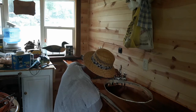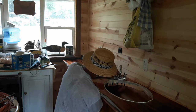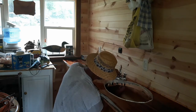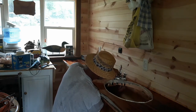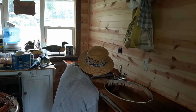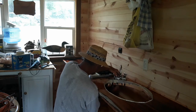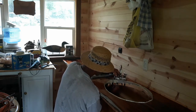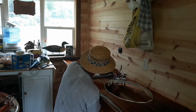The hard part with tightening these nuts up is they're clear up inside the wood. This wood is 2 1/4 inches thick, and that's how long the nipples are on the bottom of this faucet. So I had to bore out a bigger space in order to accommodate the plastic nuts. But it's going in, and once it's in place, it'll stay there.